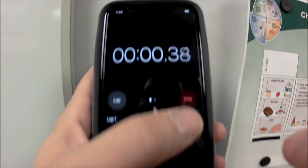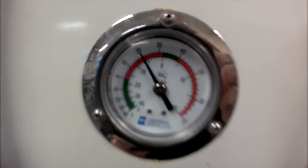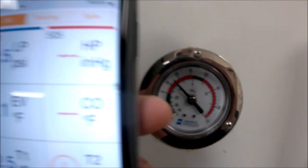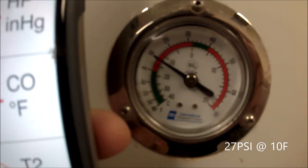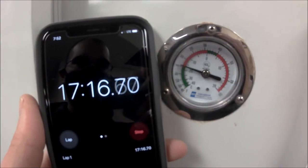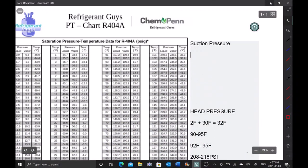Now adjusting superheat and doing a quick stress test. I put it in defrost, let it come to 20°F, and I'm timing how long it takes to get down to zero degrees - I want to be around 20 minutes or better. At 15°F our superheat is 12. At 10°F our superheat is 6 at 27 PSI. After 17 minutes we have reached zero degrees Fahrenheit.